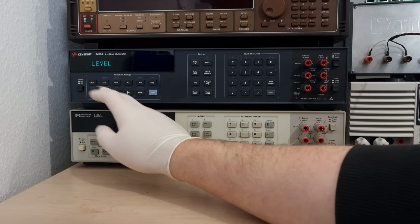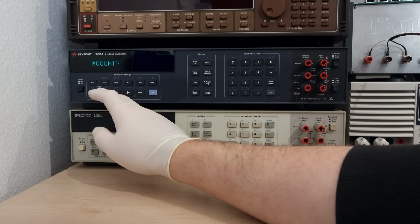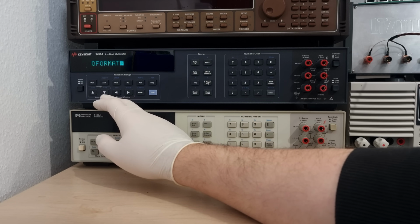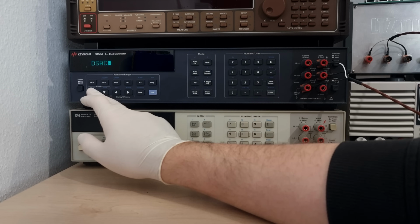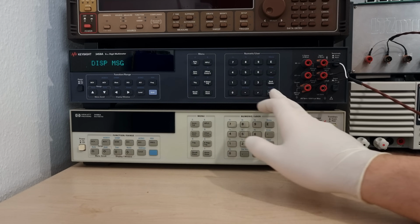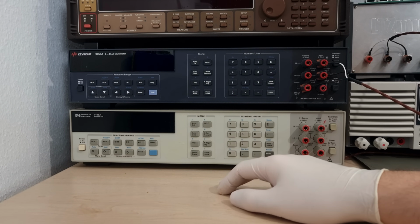Oh, in case you were wondering what the HP unit is up to without displaying anything, it's just powered on permanently as good practice dictates. You can actually send 17 space characters using the display message command, as a kind of screensaver to prevent burn-in of the vacuum fluorescent display. But even without such excellent care, they last for decades.